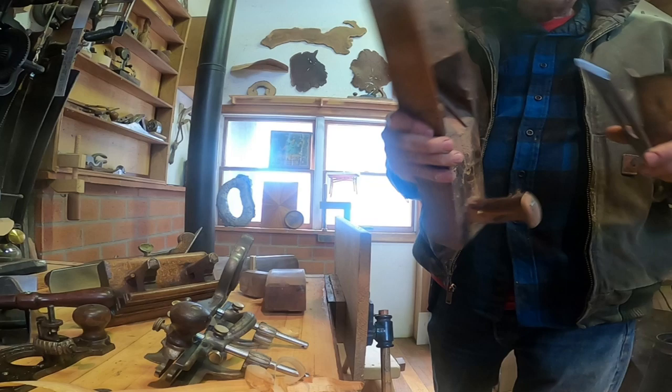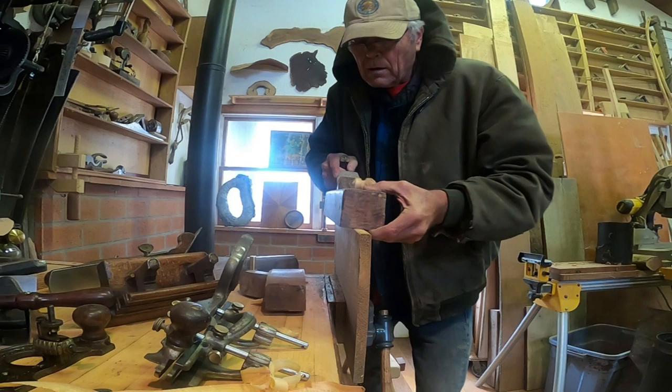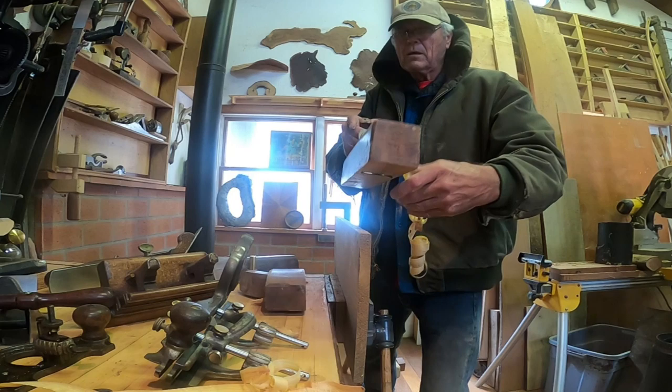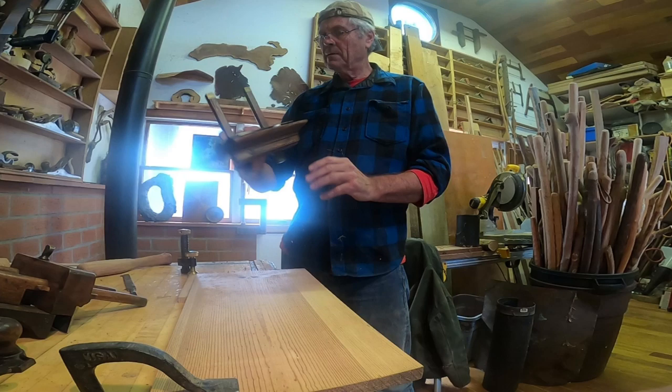This is a long one. Back in the day, everything was wood. A lot of carpenters like the feel of wood on wood. You can true up the face of this plane with another plane and make it flat again. You want to keep them smooth and waxed in really good condition - you don't want to drop these planes. Now I've put the board, the piece of pine, over on its edge. Notice this is a fairly tight-grain little piece of pine.